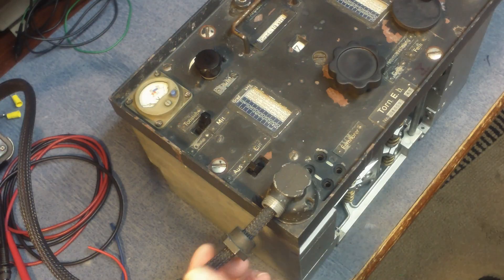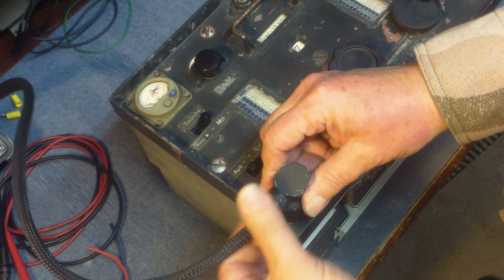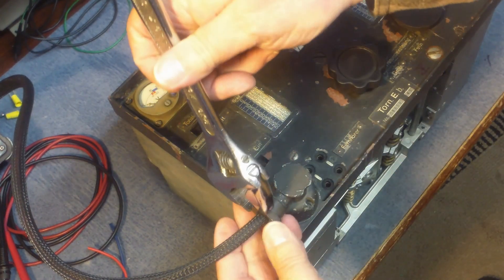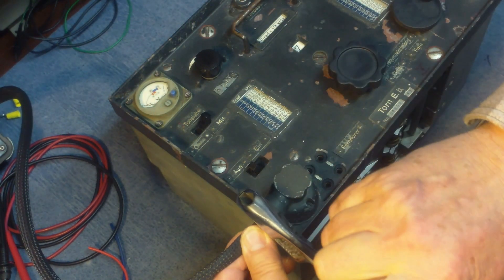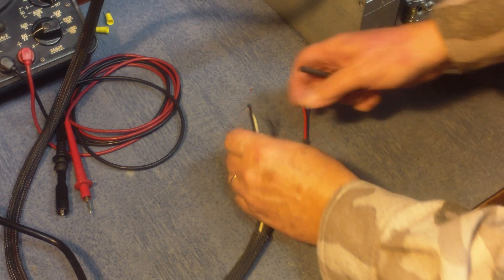Go ahead and put a wire tie around the end of the sleeve to keep it from pulling loose. There is a grommet and a retaining nut on the connector - so the sleeve's attached now. I'm going to screw the retaining nut onto the connector. Although I'm using a crescent wrench, you really don't have to use a lot of torque - it's just to make sure it doesn't come loose on its own and that it retains around the shielding.